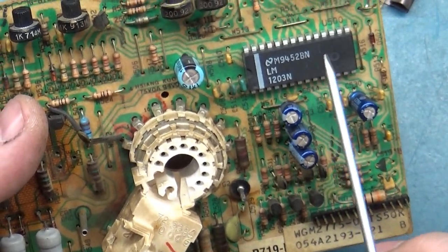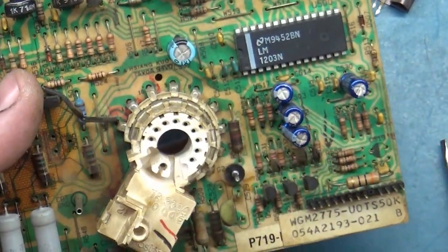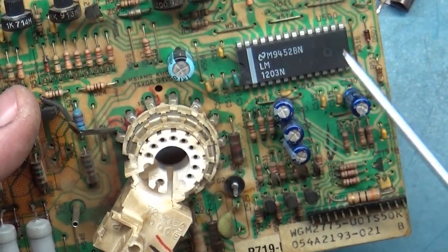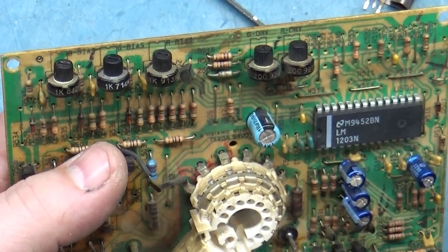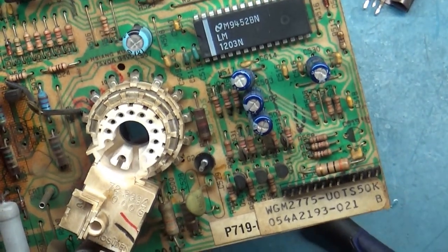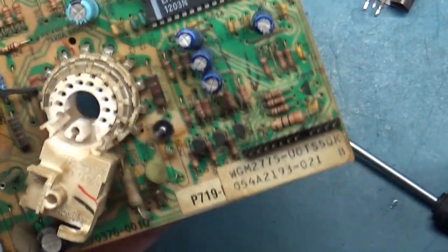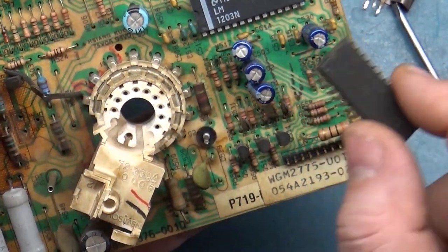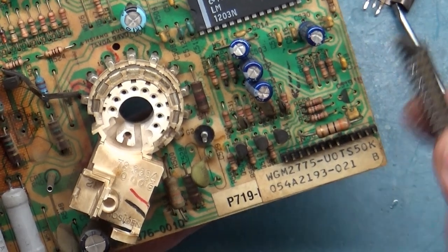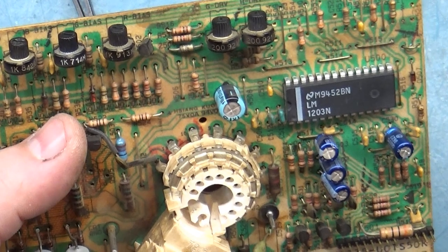So I put a brand new encoder chip in there, I actually had two in stock. After doing that, you saw everything read properly. So I'm fairly certain that it was the encoder chip, like I might have said. I think I mentioned it prior. It's been so long since I made that first part of the video. I think I mentioned the encoder chip might be suspect, but I think this actually is the problem because now I'm reading properly.